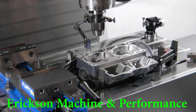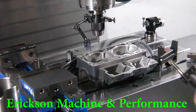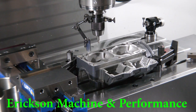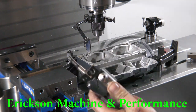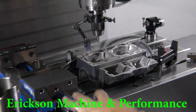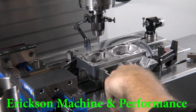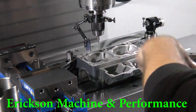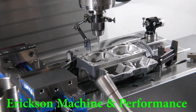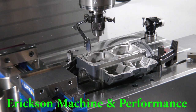I'm doing this in a CNC machine, but it doesn't have to be done that way — it all kind of works the same. You can end up using a standard boring head. Some people use a fly cutter, but I'm not a huge fan of that because it's hard to get an exact number. With a boring head it can be perfect. You can also mount the cases down to a rotary table, indicate it in the middle, and then just run it around on a rotary table. A whole bunch of different ways to skin a cat — none of them are wrong, it's just whatever works best for you.